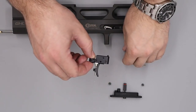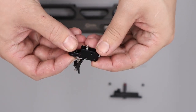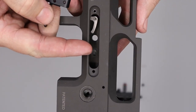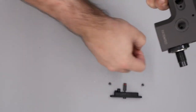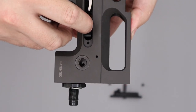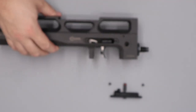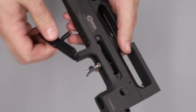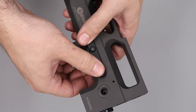Next we'll install the trigger blade. Take the trigger assembly and add the small spring and brass cup into the hole. Then, lining up the hole in the side of the trigger assembly with the hole in the block, get those two pieces mated together and add the trigger pin. It may take a little wiggling to get everything lined up, but once it goes together it should push in fairly easily. With that done, get the trigger plate and safety installed into the side, pushing the safety through and wiggling the trigger as needed.